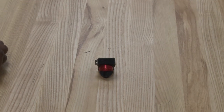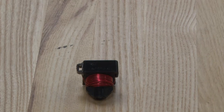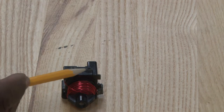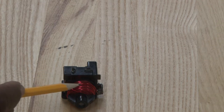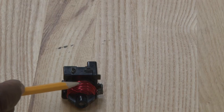If you look at it, it has a coil. It has terminals that plug into the compressor prongs on these small compressors. Basically the current goes through this, and it will generate a magnetic field only during the start-up of the compressor, during the inrush or high current levels at that point. So this is one type.